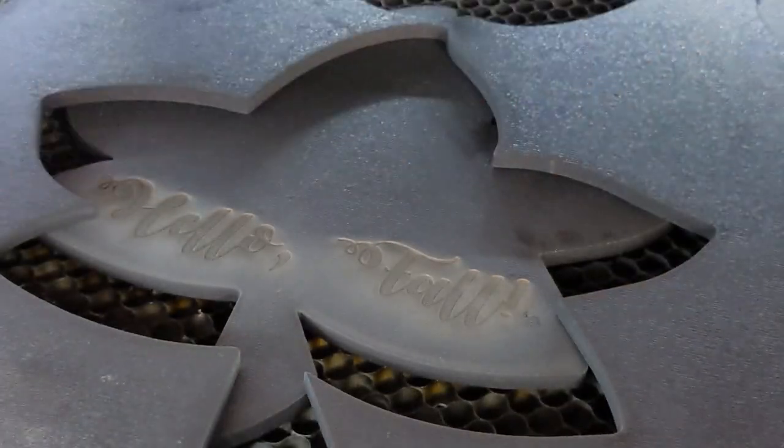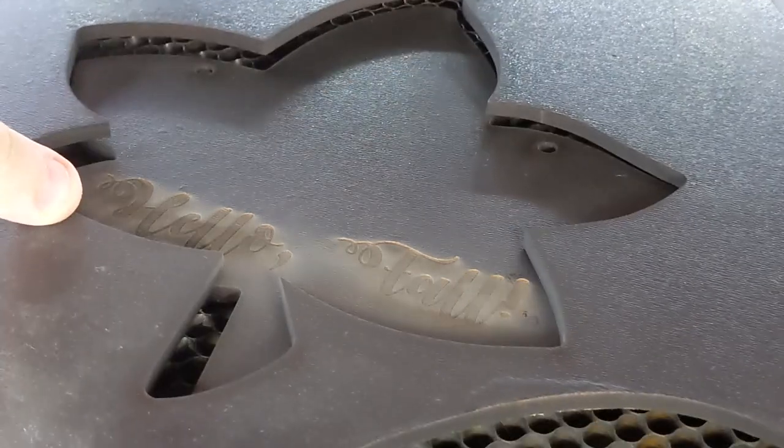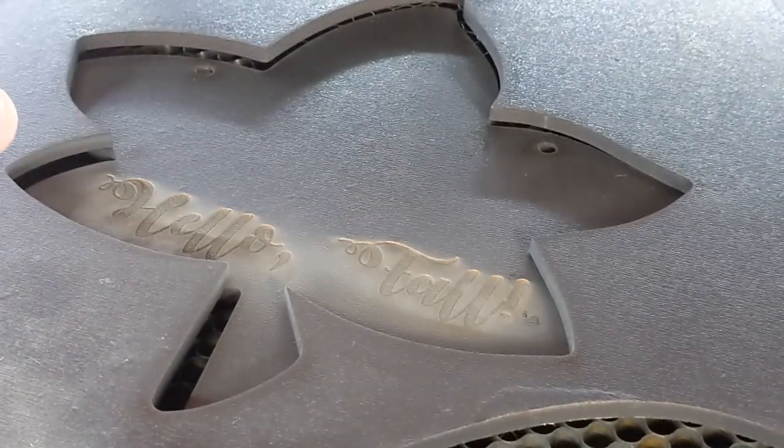Now, this is a great example of do as I say and not as I do - I forgot to swap the cut and engraving lines for the second two pieces. In the case of the maple leaf, it actually fell through and I had to stop the machine and refocus so the engraving would come out right. It's really important that you have your layers in order: the ones you want first at the top, cut should always come after engrave.